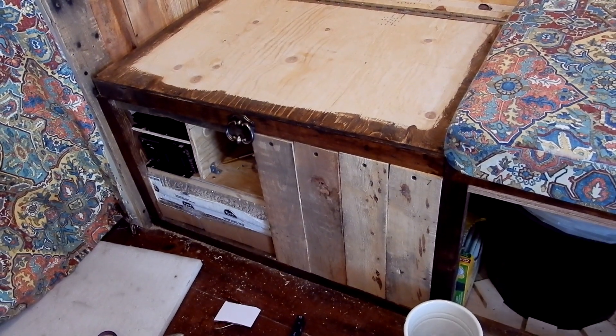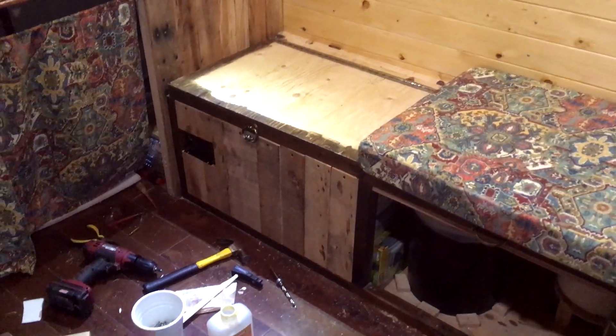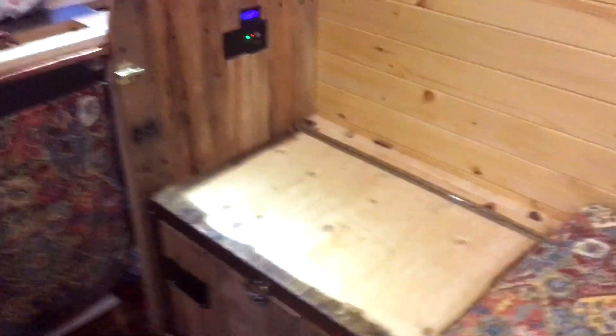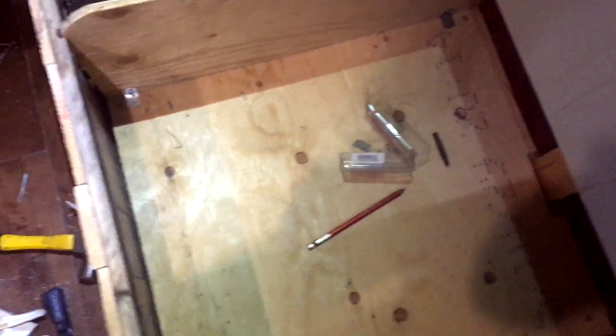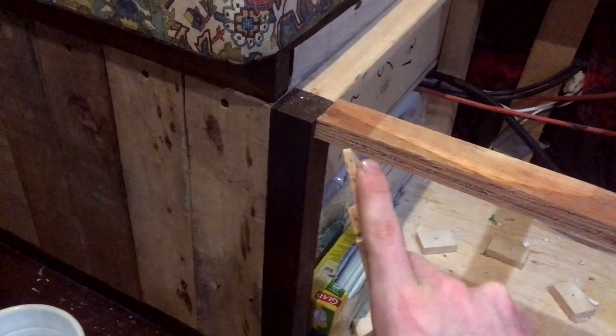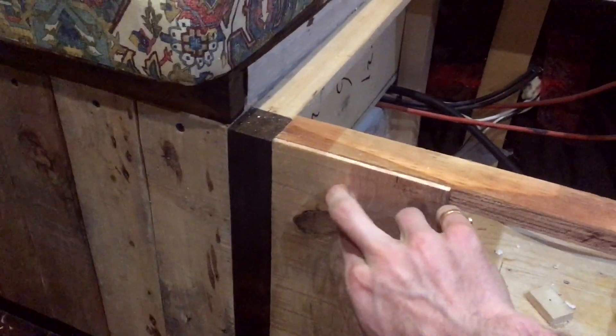Here you can see that I'm about halfway through paneling off this bench. I've finished the pallet paneling on this side of the couch and I've left a hole there for the inverter. Now if we open this up you can see that this box is fully completed and I can actually use it for storage. I've moved on to the toilet section here and this framing piece is sort of in the way, so I've shaved down a portion on this side using the table saw so that when it's in place it'll sit flush.